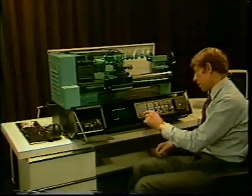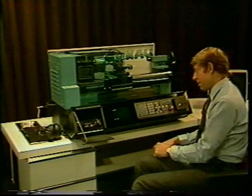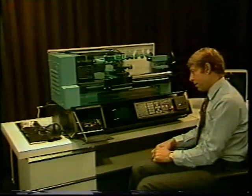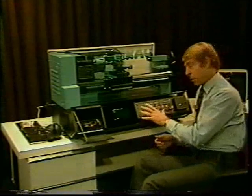Press the key with the two arrows in the downward direction to advance to the next page. Now you must enter the program datums. Press the key to the right of the incremental absolute key. Now key in the X value taken from the center line of the spindle as 15 millimeters — and presumably enter. There we go. Enter this information into memory by pressing E. Right, that's now loaded on the machine.